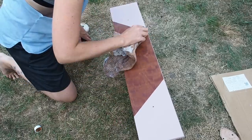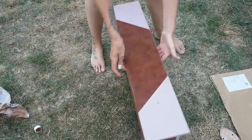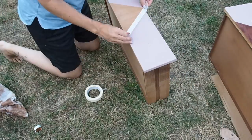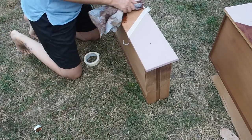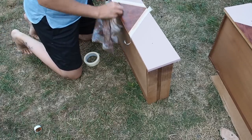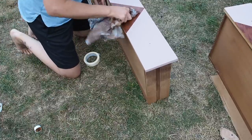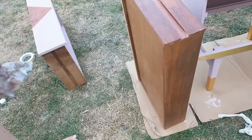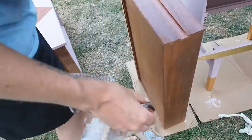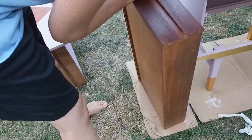That means I can rub my wood dye on there without worrying about getting any on the paint. The tip here is don't press the masking tape on too hard because you don't want it to pull up the paint you've already done — just press it along the line to make sure there's no bleed through. As soon as you've applied your wood dye gently peel off the masking tape, then you can touch in any sections with your finger neatly and leave it to dry. I also added some wood dye to the sides of the drawers and the top edges that I'd masked off and didn't paint.